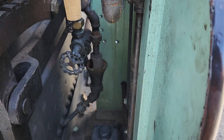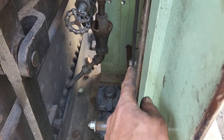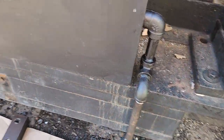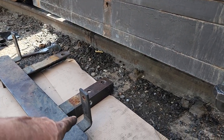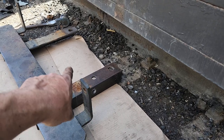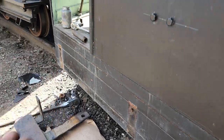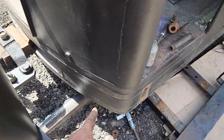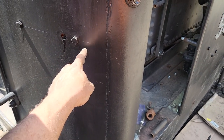Coming out of the other side of the feed valve, you see that pipe going through the front wall of the cab, coming out and wrapping around. Then that's going to go under the platform. I had to take this step off and drill a couple holes in it so the pipe can pass through that. Then it's going to come around back and come up here — there'll be an elbow and another elbow.